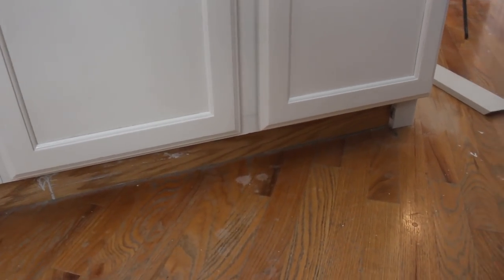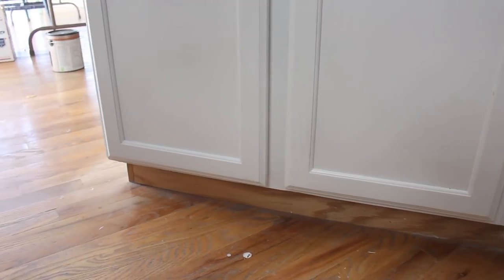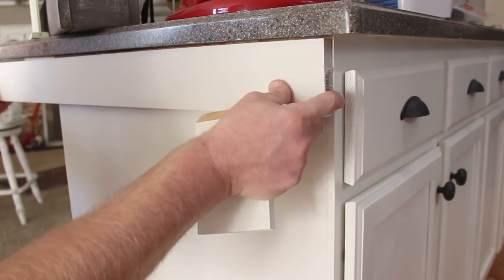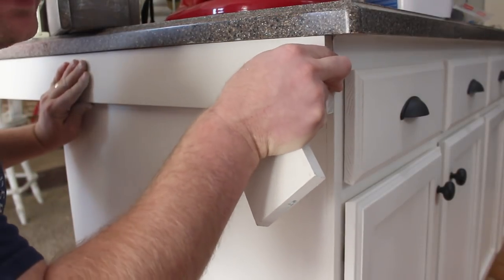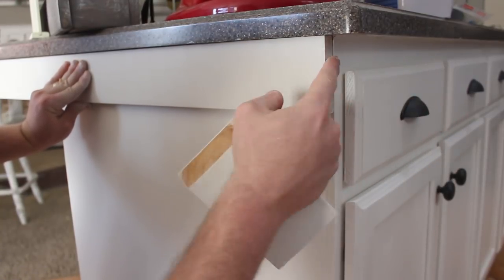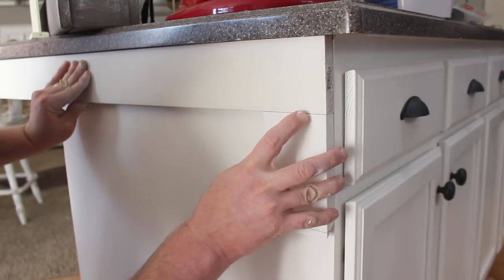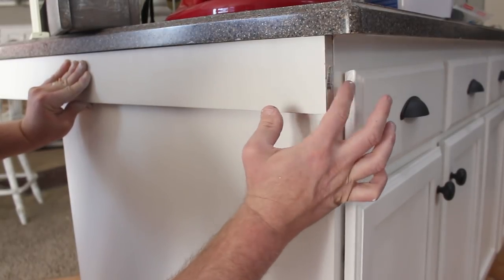You can see the little piece of trim over here in the corner — the little excess that I've been using to measure. I've got to cut pieces for the top and then I'll bring them all in and show you guys how I put them together. Before I go cutting this on the top I just wanted to show you this part: I'm going to leave the face of this top flush right here because I'm not going to put some little trim up above where the drawer closes. So this is going to be flush and then this will have a piece coming down right here on the edge, and that will meet up down here on the bottom. I'll have to put a little bit of caulking in there and smooth that out and then we can paint that.